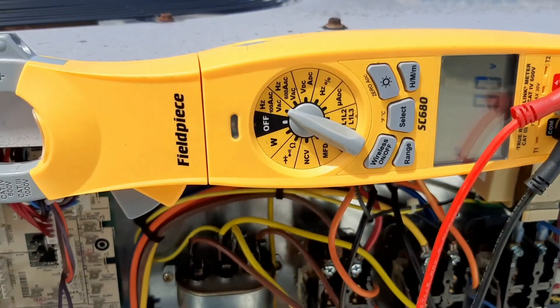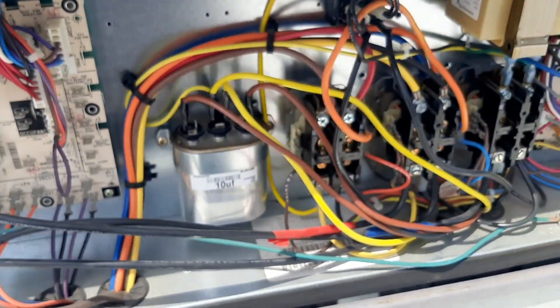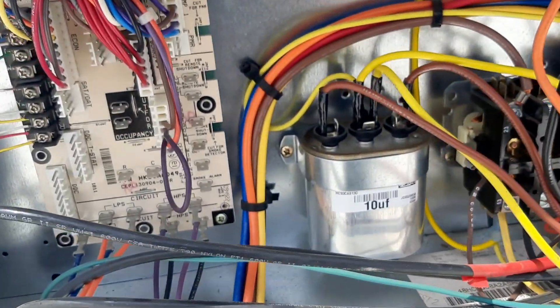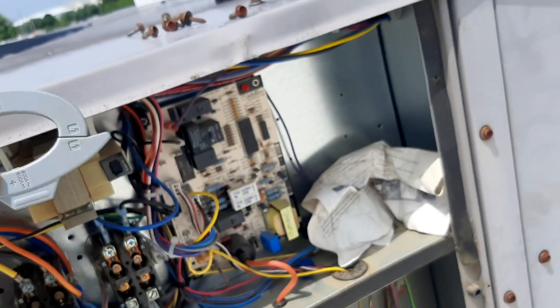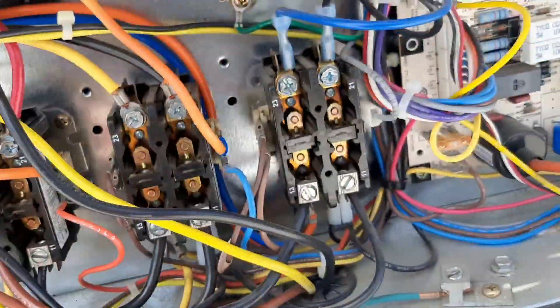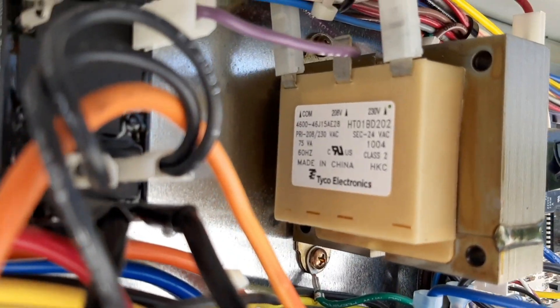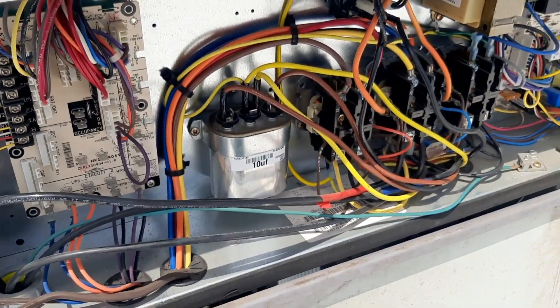I got my stages jumped out too. Customer was messing with me — probably thought I was blowing hot air so they turned it off again; it was off when I got here. I wish they wouldn't do that. We'll go down and kick the thermostat back on. We've got 211 volts — I wish it'd be tapped for that 208. If we look, I've only got 24 exactly. Let's tap it right and see what our low voltage looks like, then we'll go kick the stat back on.